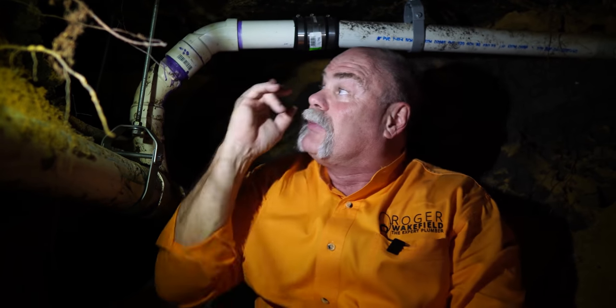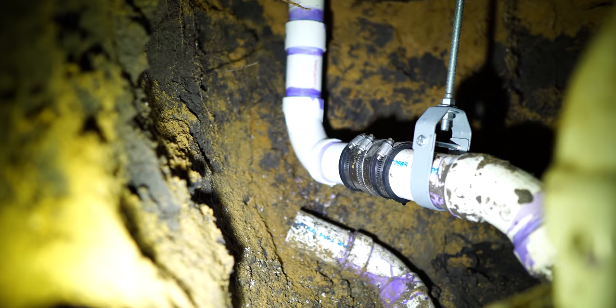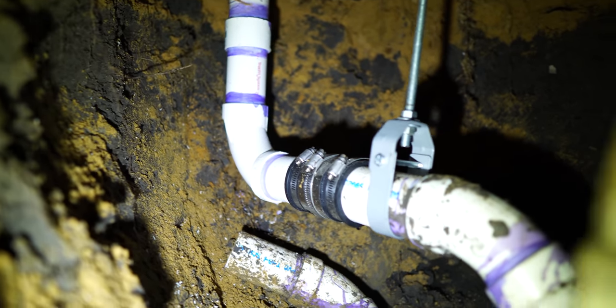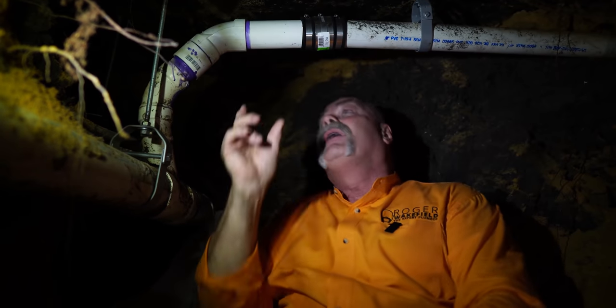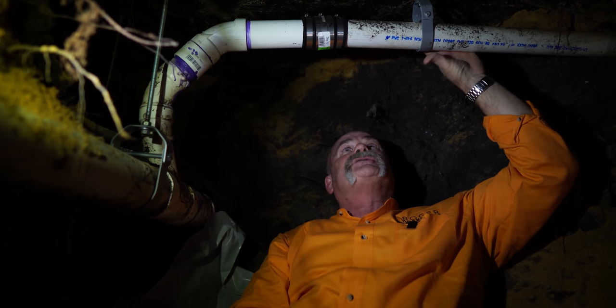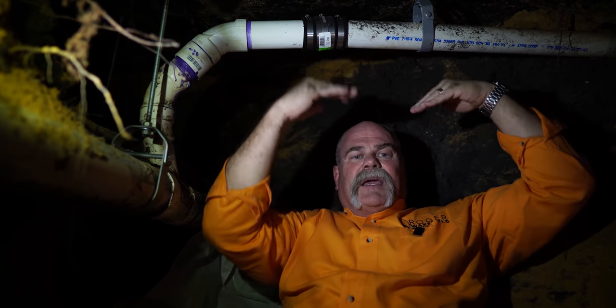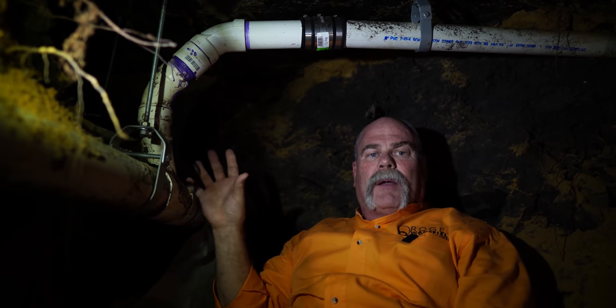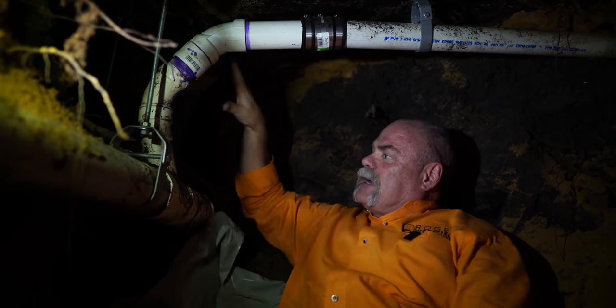The other day there was literally a break on this line and a break back here, with multiple breaks on this one. We've already replaced the line over here. We put a hanger up back here, hangers up here, and a shear band right here where we replaced this section. We left this piece over here but put up another hanger just to make sure this doesn't get pulled into any bind or stressed in any way.